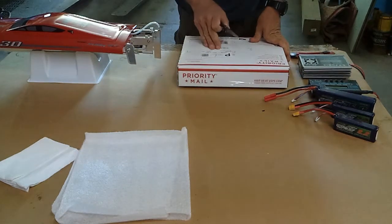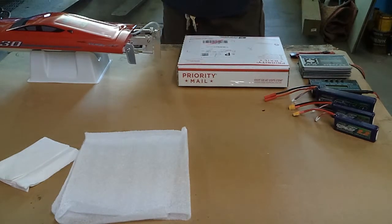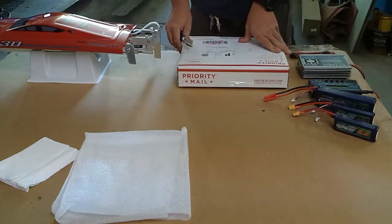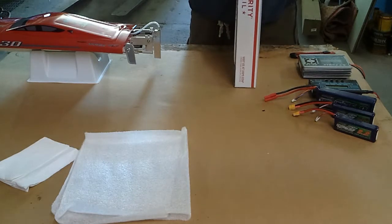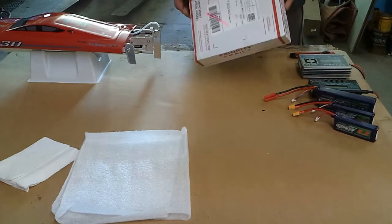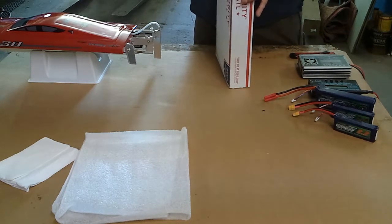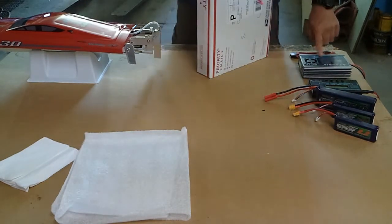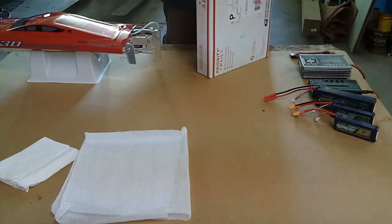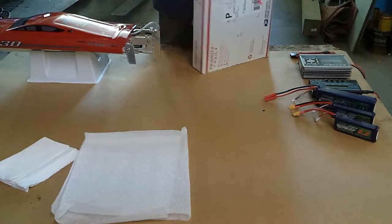So today we're going to open this new charger, take it straight out, and charge two 3S Turnigy 2200s that are at storage voltage right now — charging those at 12 amps in parallel — basically just testing the ability of this charger to do its rated amperage at that voltage as specced. The specs look really good and it's a nice-looking charger. It has capacitive touch buttons instead of pressure-sensitive buttons, so they don't click — they sense the capacitance in your body, like a smartphone touchscreen.